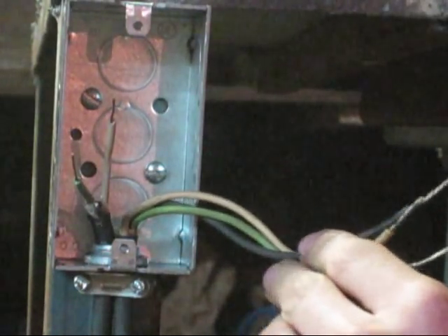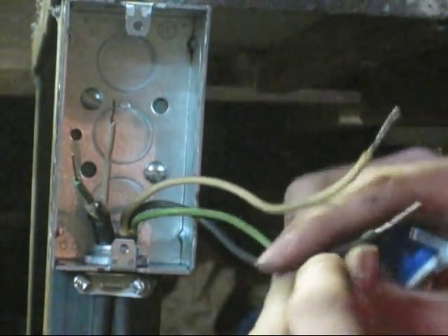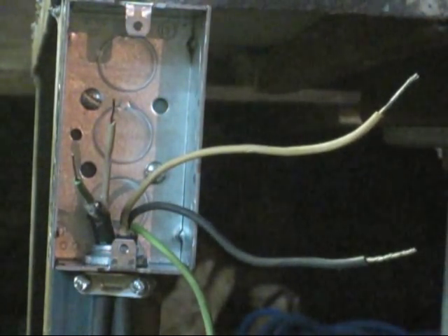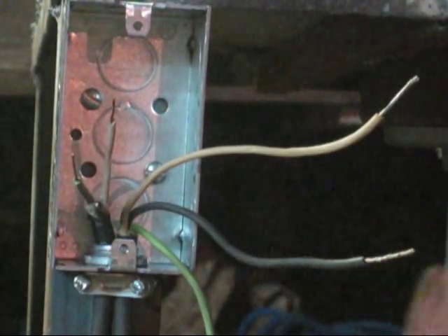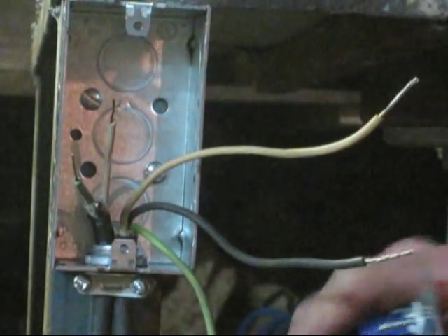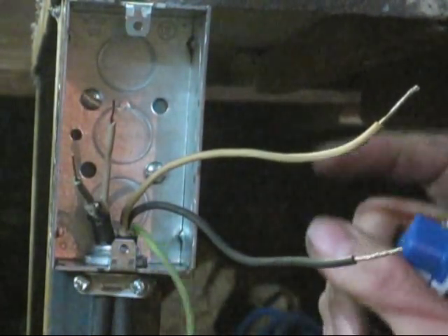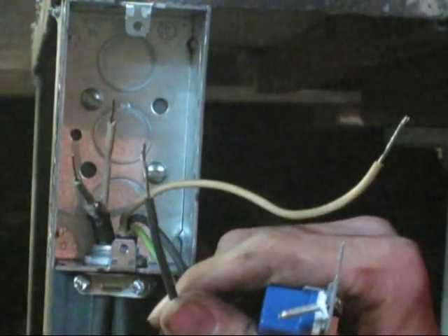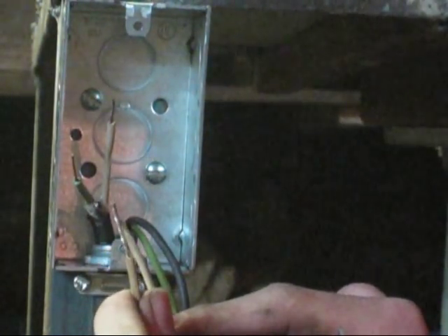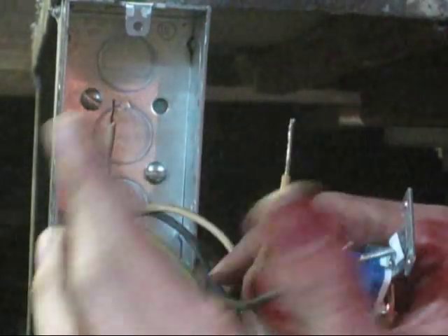I know this looks like a mess in here, but it's really not. It takes all that just to put in a switch. I'm going to tell you a little bit about wiring in case anybody doesn't know. Whenever you're looking at three-stranded wire, most wire you'll see in common household use is what's known as Romex. Romex has two color-coded wires and one naked wire, and the naked wire is your ground wire. But when you're in this kind of strand, everything's insulated, so you have to know which one's which. Your green wire will always be your ground. Your hot cable will always be black. And then you'll have a third wire known as your neutral. You have to have a neutral in AC current to return the current back to complete the cycle, so that it will have power to go somewhere else.